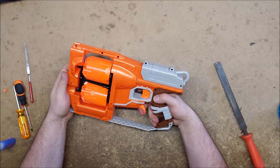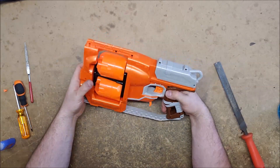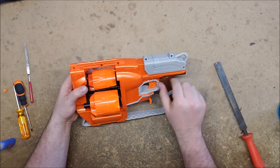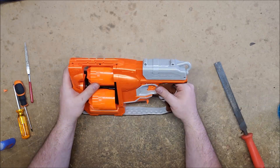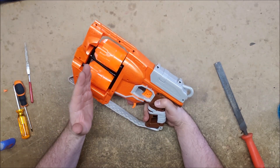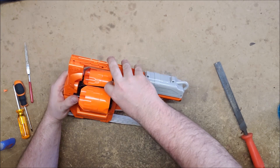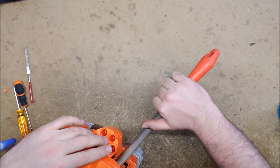It lives! The cylinder assembly rotates; cylinders rotate after you fire. There were two things I had to fix. The first was the tab that engages the release lock — the part that holds back the rotation lug so the whole barrel assembly can rotate — which was not quite correct. It would simply pull back a little bit and then snap forward again, so it would never actually release. The second issue was that the actual locking lug was too long.